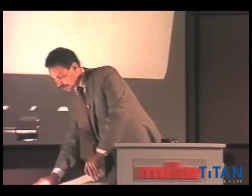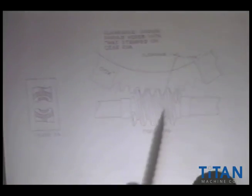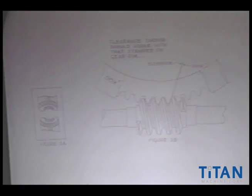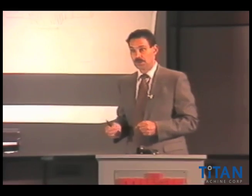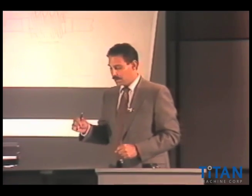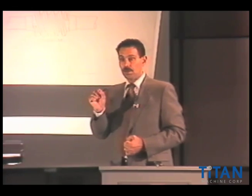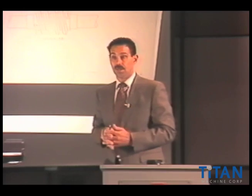This is a diagram of the actual clearance — you can actually see a gap in between these teeth. That clearance is there for a reason. As the gears start operating to full temperature, they're going to get warmer. That allows for thermal expansion. After both parts expand, there still should not be any resistance between the gear teeth — they shouldn't be so tight that they bind or pinch.